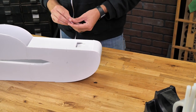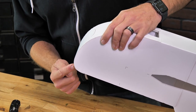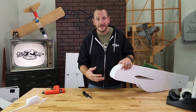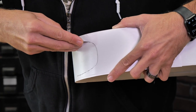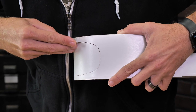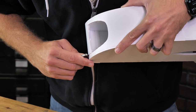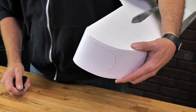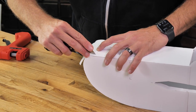Our last step on the bottom of the fuselage is to connect the dots and remove the excess foam from where we need to allow the power pod to slide through. Cut between each dot, and once there are no more dots use the razor blade to cut against the side cheek of the doubler and finish that cut all the way up to the very top.